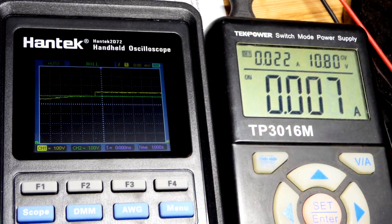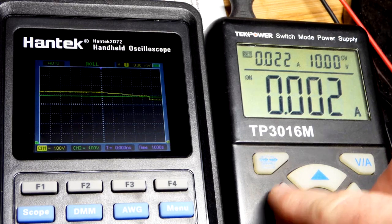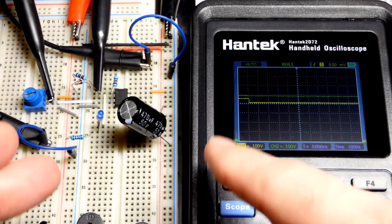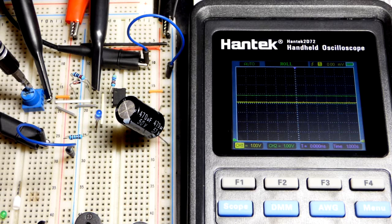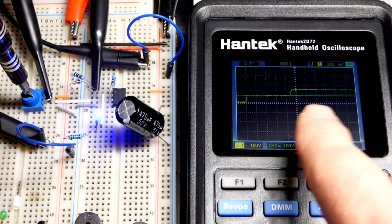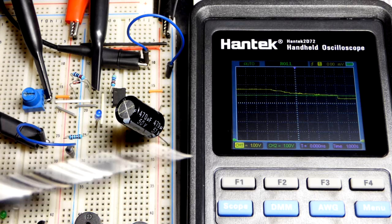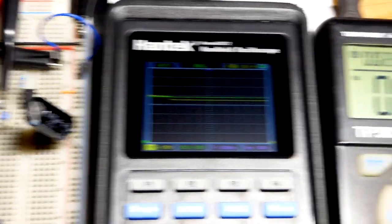So we got 9.9, it dipped down and then we go back up. You have to go back up to about 10.8 right there — you can see it bumped up again because of that feedback resistor. Now let's change this so we want the power supply — I'm going to drop it down to 9 volts, so it's going to be off. We can go up to 12 volts with this. The weak thing though is the resistor protecting the LED. We could use a higher value resistor and go even higher in voltage. So we got the voltage where we want to turn it off. To begin with we have to turn the LED on, so I turn the signal voltage up. Now I just have to turn it down until it gets to 5.1 volts because that's what the Zener diode voltage is. And you can see the LED just went off — that is what we want, to stop turning the trim pot right when the LED turns off. That's how we adjust it.